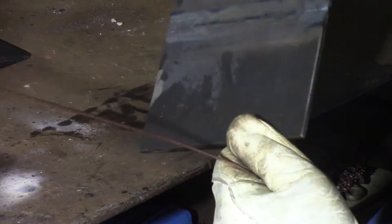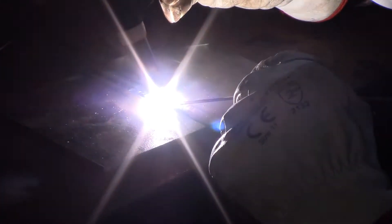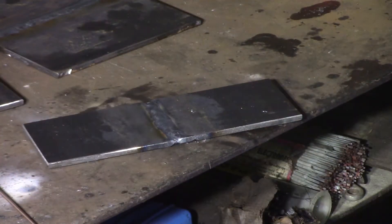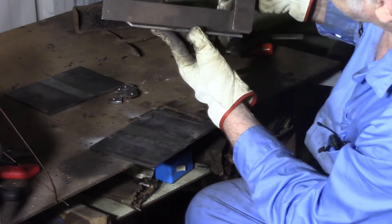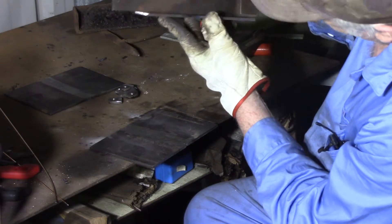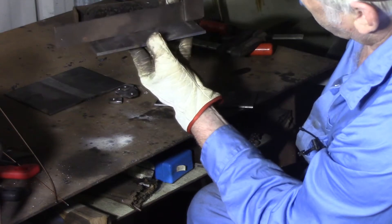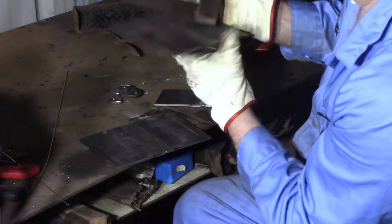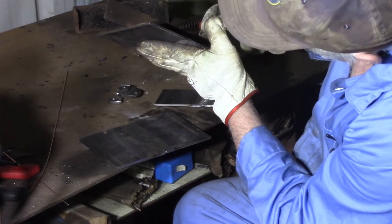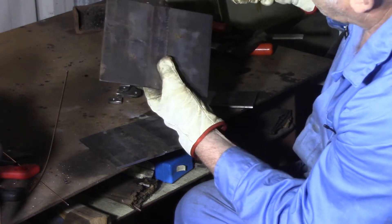Parts 002 and 003 were just a repetition of the same process, with the material cut to a different length. I grind them off and I did pretty good with these — got them all ground down, and just barely see some daylight at the end here. One of them is pretty near perfect with no daylight, and same on that side. The other one's not quite so good — you get a little bit of twist, maybe about half a mil to three quarters of a millimetre over the width. But that's okay.